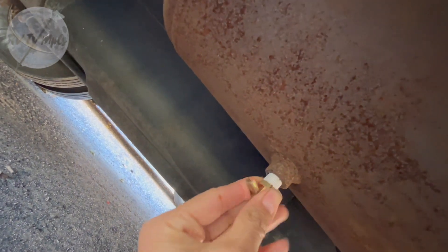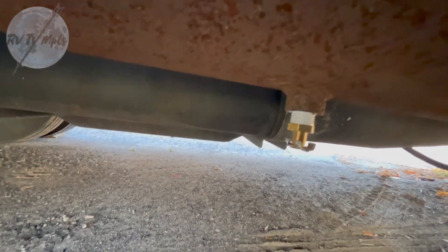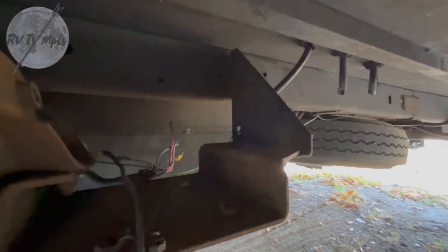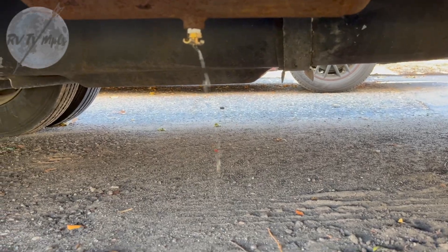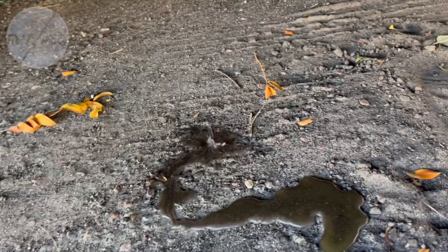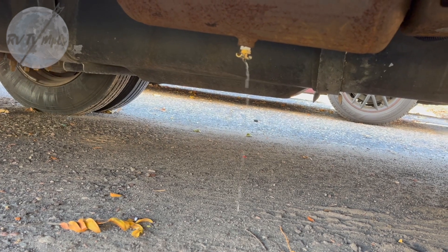I'm gonna start with a new drain for the air tank — I wanted to get all new fittings for this tank. You can see all the moisture still kind of dripping on that tank. By doing this I'll be able to drain this tank now because that other drain cock was not draining anymore, so this thing had not been drained in a while. Just like I expected, as soon as I put that in and opened it up, it started leaking — weird how that works. There had obviously been a lot of moisture in that tank, and it's a really good drain because it's going to get that whole tank nice and empty.